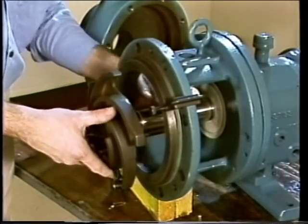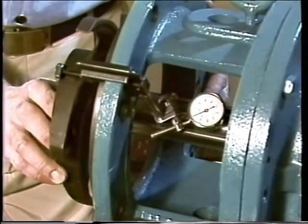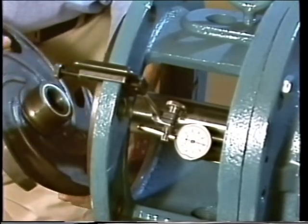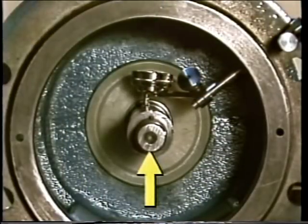The process should be repeated with the shaft sleeve and impeller in place to check for sleeve runout. Once the sleeve runout check is complete, the impeller and sleeve can be removed from the shaft. Dial indicators can also be used to check wear of both radial and thrust bearings. To check radial bearing wear, a dial indicator is mounted above the shaft and the shaft carefully lifted to measure radial movement. Excessive radial movement could indicate worn bearings; refer to manufacturer's guidelines to determine if wear is acceptable.